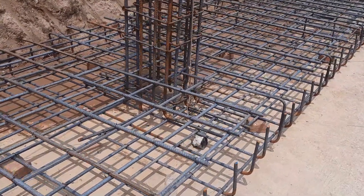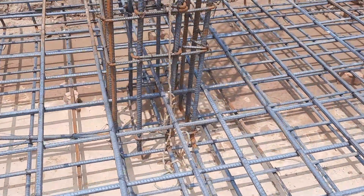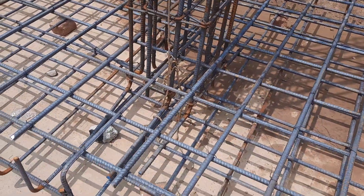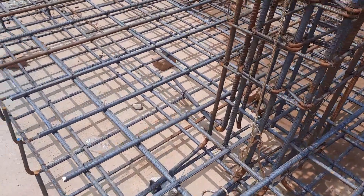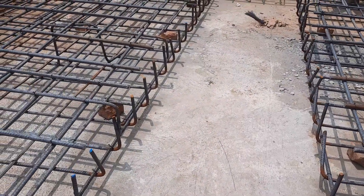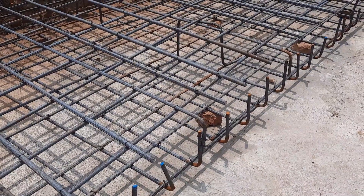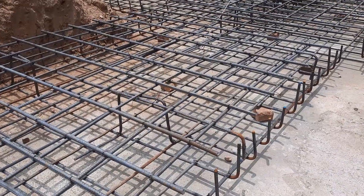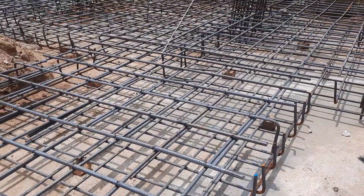The hooks length should not be less than six inches. Unfortunately, you can see in this steel reinforcement design the spacing is six by eight inches — this is a doubly mesh. In both portions, you can see the upper portion hooks were not provided; they did it simply, so this is not the proper design.